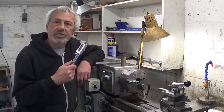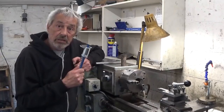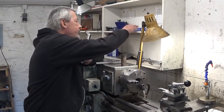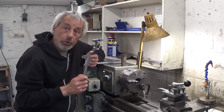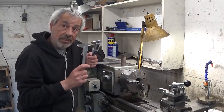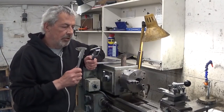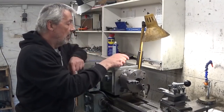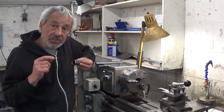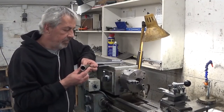Now I have to measure with my calipers, and this should be quality calipers, but the feel is not really what it should be. I have here my old Mitutoyo. This one is fantastic, but I cannot read less than 1/20th of a millimeter. This one 0.01. So my plan is now to bore this pipe out and then adapt a cylinder so I can feel, you know, feel is always better than measure. That's the idea.